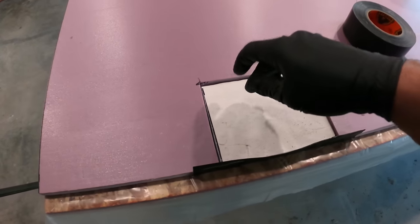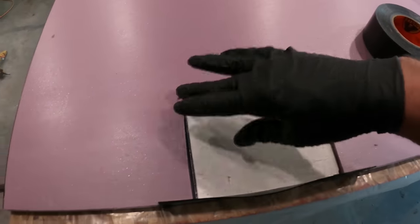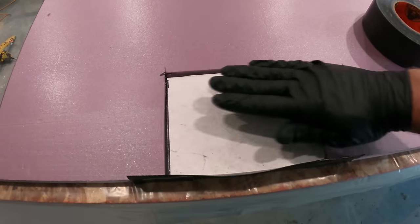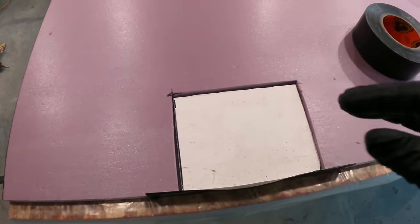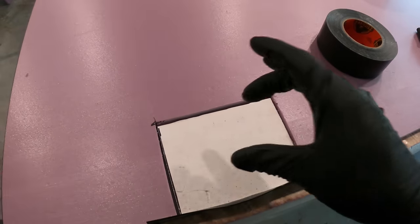So I put this here, even though it's only 3/8 and this is 1/2 inch, I'm going to fill that in so that it's solid epoxy. And that will give me a solid spot that won't compress when I attach that piece for the shower door,